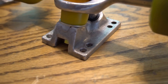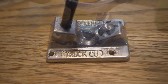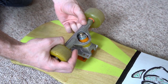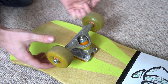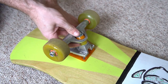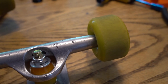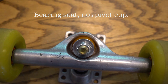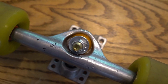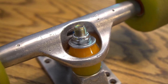Let me tell you a little bit about my design. The first thing I did was double up on the mounting holes. Most modern trucks are drilled in the new school pattern, but for my trucks the outermost holes are the old school pattern, while the two sets of shorter hole spacings are both new school pattern. That means if your deck is drilled new school, you can have four wheelbase options by moving either truck closer or further from the center of the board. The hangers have a slight taper to help reduce weight and may also help with locking into grinds. With the pivot cup, I brought over an idea from longboarding and made it a bit wider to give the bushings more space to deform - I'm hoping it will make them more turny or carvy. I also need to make some adjustments so the kingpin isn't sticking up so much.